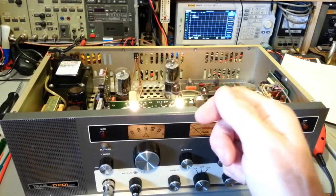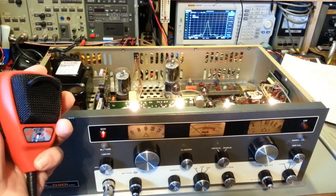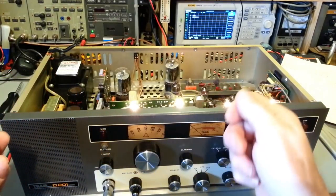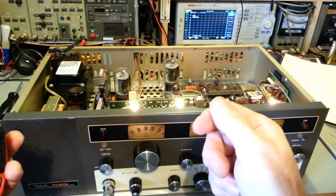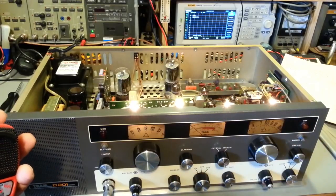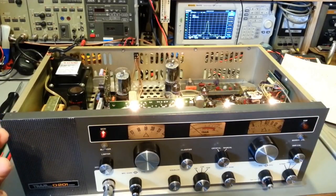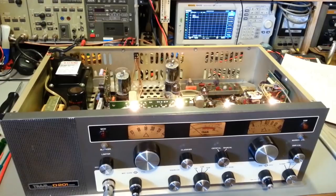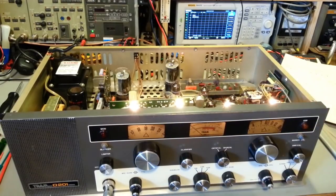Anyhow, the instant I had the radio keyed, microphone in my hand, I keyed the mic and grabbed the scope probe. The instant the scope probe touched that wire from the balance modulator board terminal to the driver tube, it started working. And you can hear that click over there. That's my BK1040 clicking in because, yep, it's doing a little bit over 4-watt carrier now. I've still got the span set to 50 kilohertz. But, yeah, it's working fine.